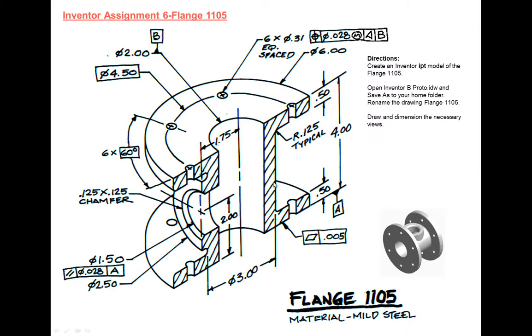The other change is that we don't have this chamfer, so we'd physically delete that out. And then we would change this hole to be a counterbore with a flat end bit. The reason is, if you cut through this new body, it has a protrusion back here and it needs to have a flat hole. If you do not make it a flat counterbore, the tip will break through that protrusion in the back. I'm going to pause, pull up this part, and get you guys input sheets so you can pull this part up and change it into your new part.